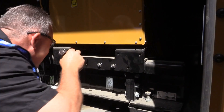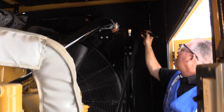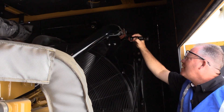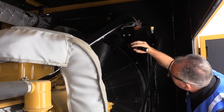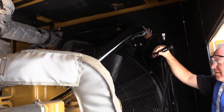If you see signs of animals or rodents, then it's a good reason to call for the generator to be serviced. Once you've opened the enclosure, perform a visual inspection of the belts, hoses, and radiator for signs of deterioration and leaks. If there is debris located around the outside of the generator, it normally gets drawn into the radiator and causes cooling problems.